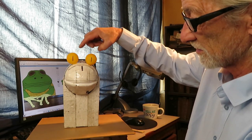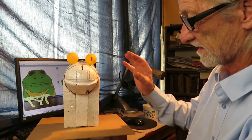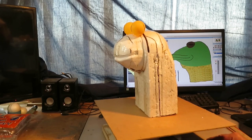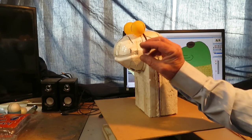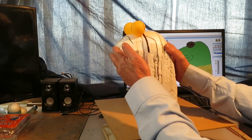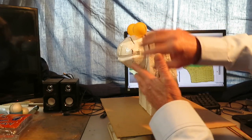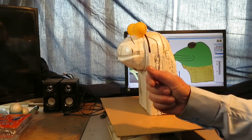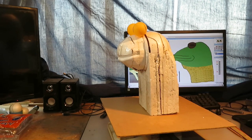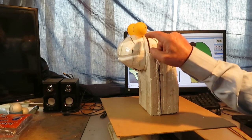I stuck on the eyes so you can see where they go, but then I have to cut them off because they can't be there when I'm putting the clay on. The problem is that this figure is a little big, so putting your hand in there to apply silicone inside this sector will be very difficult. It isn't like applying latex — since latex is liquid you pour it in and move it around forming layers. But with household silicone we need a putty knife or plastic spatula to apply it because it's much thicker and gummier.